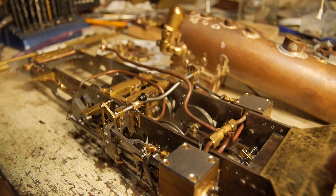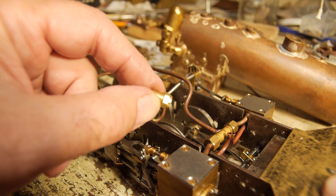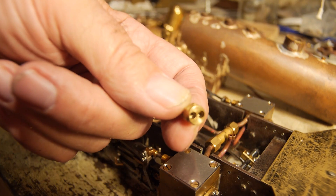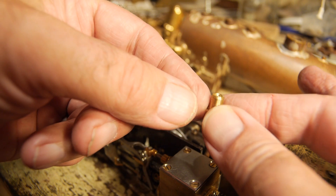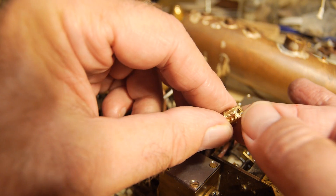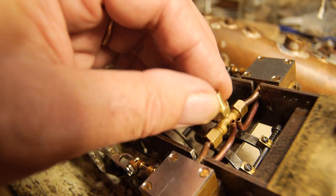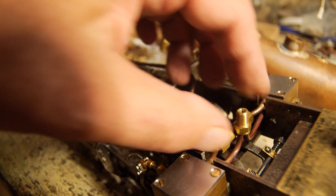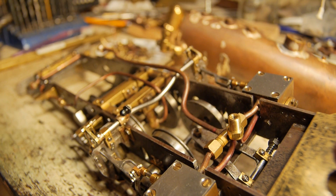What I've done is made this out of a piece of hexagon. You can see it's got two holes in it — it's threaded and there's a single hole on the other side. So it's two holes here joining up with a single hole. This fits over these two pipes like that — it's just a push fit. This part's already going to be assembled on the smoke box.